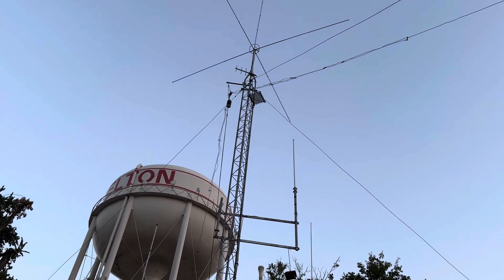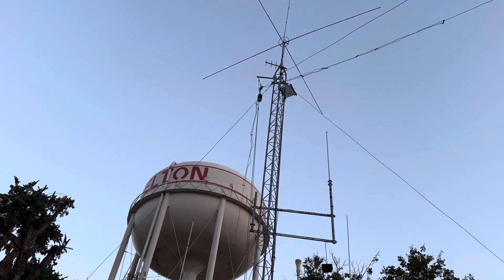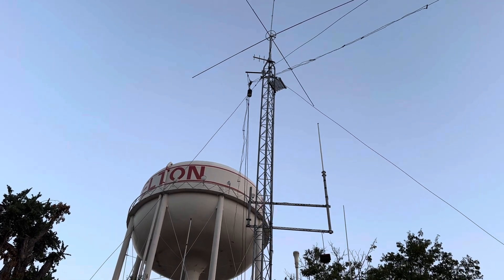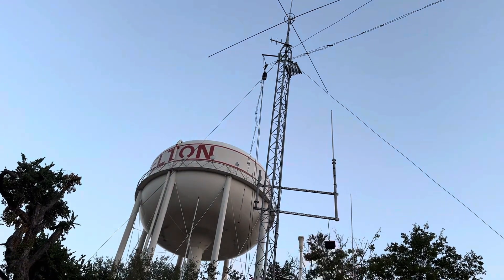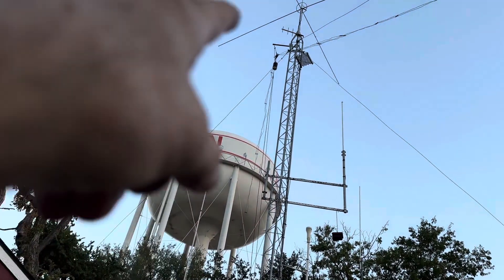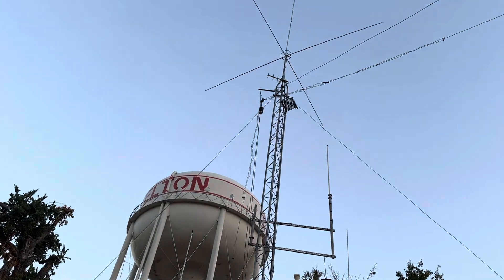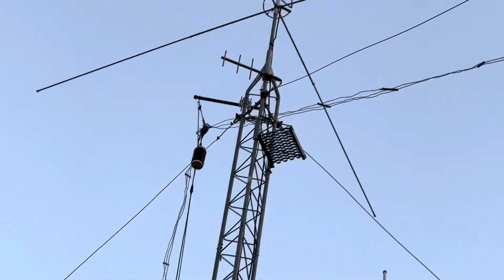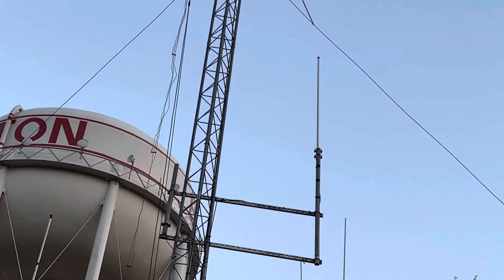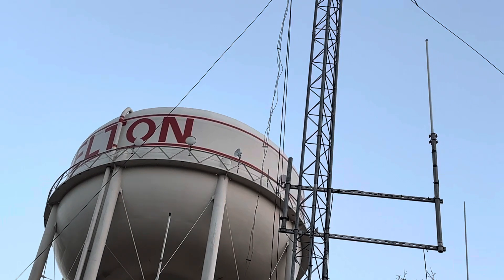Today we took the unistrut here for my Diamond 2-meter, 70-centimeter VHF UHF antenna and moved it from the northwest position to the south position to get it out of the way of the pulley system there. And we raised our GMRS antenna at the top where it's not impeding anything. So now we have a clear line of sight from the pulley system there, with the GMRS antenna not getting in between anything, and now the strut has moved out of the way.